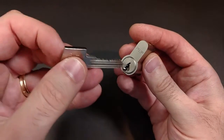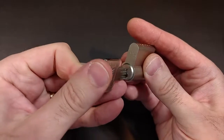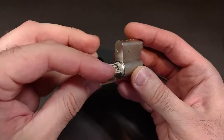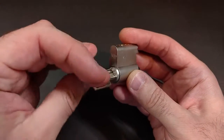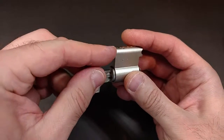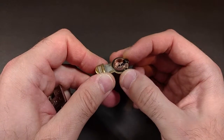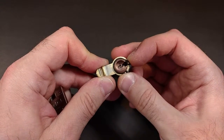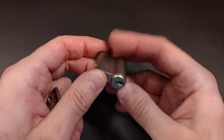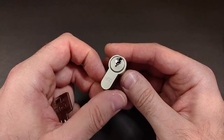It makes it a kind of tricky lock. You almost have to pick through it twice — once to get the pins sort of halfway up, and then once to complete the pick all the way up. This is a very smooth operating lock. It feels like it's got a little wear, but overall pretty good. I've taken the liberty of replacing the circlip with a little snap ring, just so that when we go to gut it, it'll be a little bit quicker.